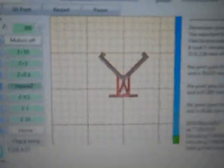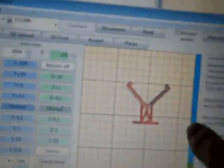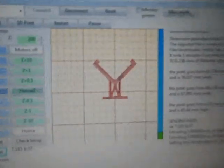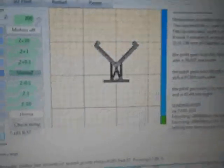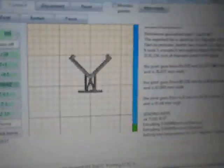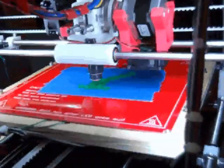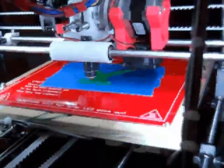It should clear this right here and allow me to go full 200 millimeters again. Right now I've got it limited to 180 by 180. That's why the last two or three ticks are off the right side here. I purposely did that in my Pronterface configuration to not allow me to go any further and crash it out — not knowing what it would actually do if I tried to print a very large print.